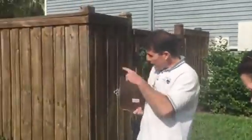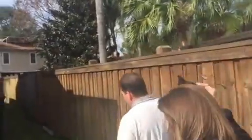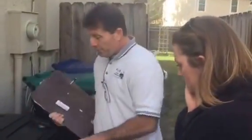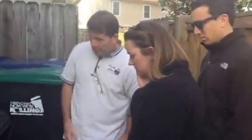Now this guy over here is where the water comes in. Always remember it's important to keep it insulated and protected. This is your main valve, and the reason I say that is see how he's got his garbage cans here and there are obstacles around. If you're going to use a landscaper, or you forget it's here and run into it with a mower or a weed whacker, you can break it. So if you're not going to have stuff over here, maybe get a couple of cinder blocks or just kind of protect it.